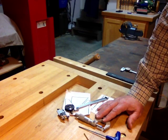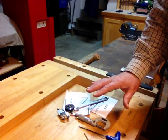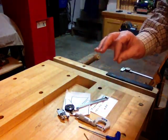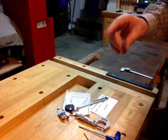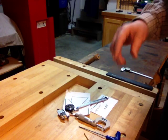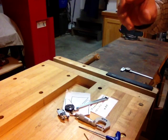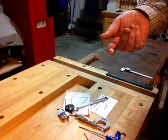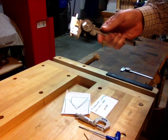Whatever system you use, it doesn't matter. Measure all six strips. Write everything down. Glue the rod up and measure your flat-to-flats on all three sides and make sure that you're getting the number and getting the same number on all three flat-to-flat measurements. I wanted to show you the V-Block because I think it's a great tool.